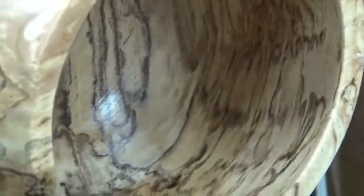That is now dry, and if you look in there, you might be able to see brush strokes from the brush that I used to apply the sanding sealer. So that's why you need to denib it at this point before you use Yorkshire Grit. So I just take a piece of a scouring pad and denib that whole thing inside. You could use the last grit of sandpaper that you used, which would be 320, but I just like to use a scouring pad. And then have a good look in there, make sure that there are no streaks of sanding sealer.